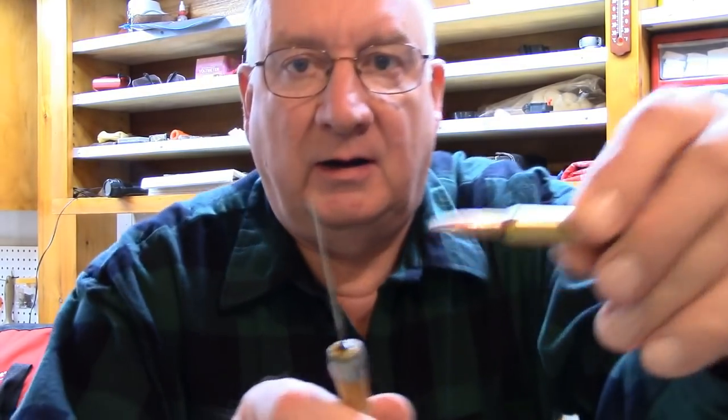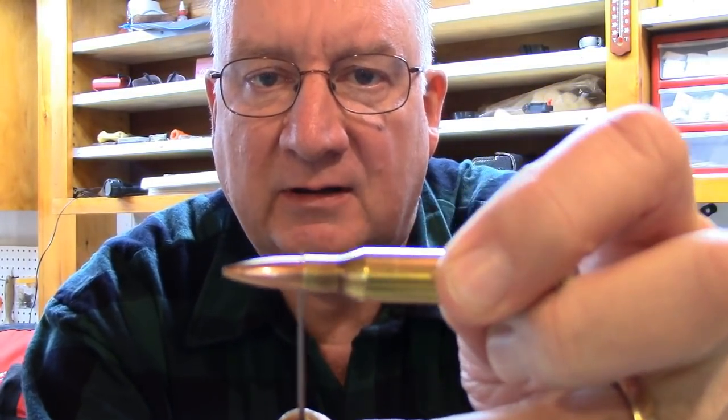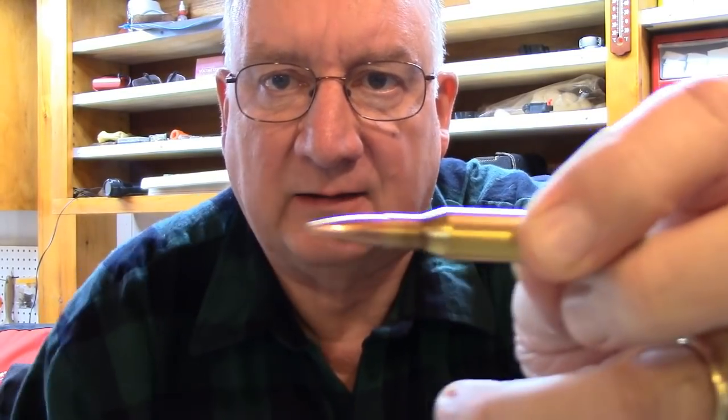One thing that is a standard cardinal rule, if it can be achieved. Now there are certain cartridges, like the 300 Savage, that simply do not have a neck length which satisfies this so-called cardinal rule, but it's generally stated that the length of the bearing surface at the neck should be 1 caliber deep. So if you have a 30 caliber bore, a 308 bore, the bearing surface of the bullet should be seated 308 deep.